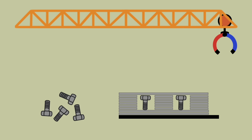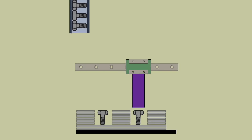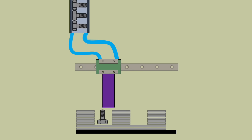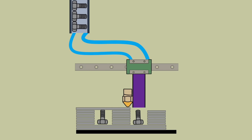However, a pick and place setup would be quite large and slow, and the robot would not know the exact orientation of the screws at the pickup point — for that, we would need image recognition. Instead, we can use the feeder module from the last videos, where the screw position in the magazine is exactly defined. We can build a much smaller motion system that we stack directly on top of the printer with the same footprint. Instead of feeding each screw individually, we let gravity do the work and place the feeder above the printer. Connecting the end effector to the magazine via a tube lets us feed screws fast and easy. Two problems remain: the screws stacked in parallel in the magazine must be reoriented to pass through the tube, and the robot arm can't be in the 3D printer's range of motion while printing, so we need a way to retract the end effector.